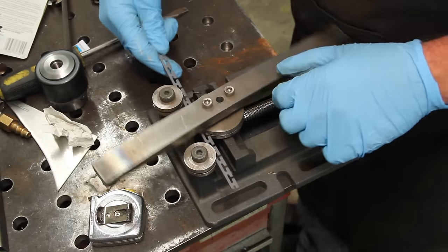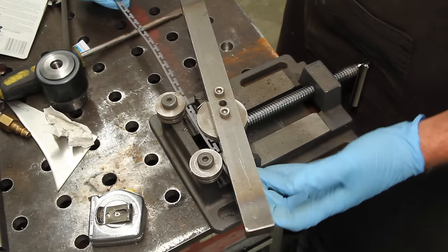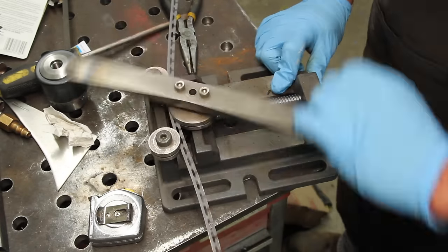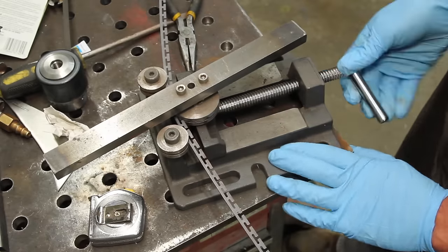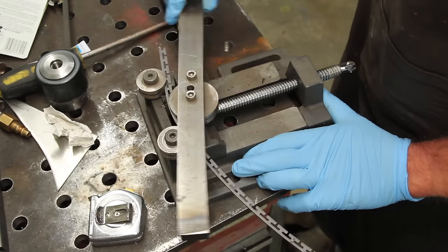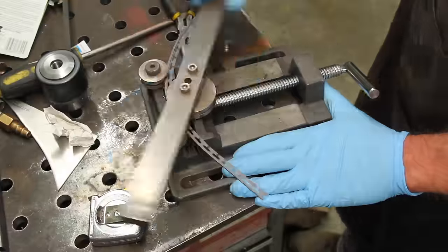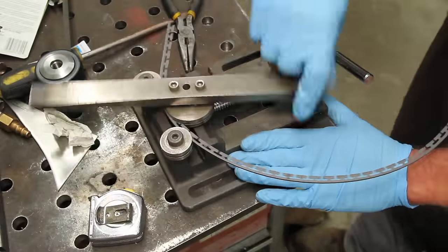The next step is one of the more tedious parts of the process, bending the edges. I'm doing a full wrap edge, but doing it in 4 pieces, tip, tail, and 2 sides, makes it a lot simpler. This little homemade bender is made out of a cheap drill press vise. It's a pretty slick base if you need to make a light-duty ring roller.